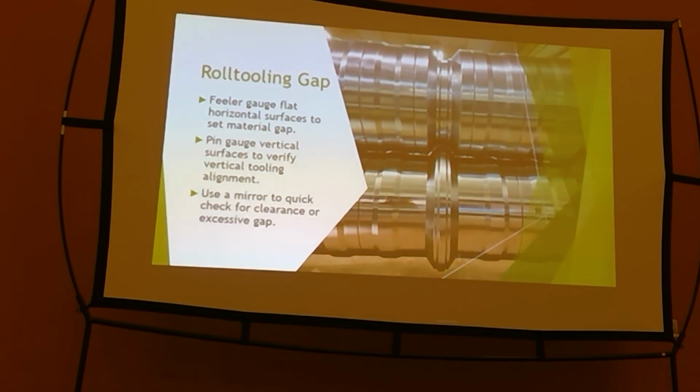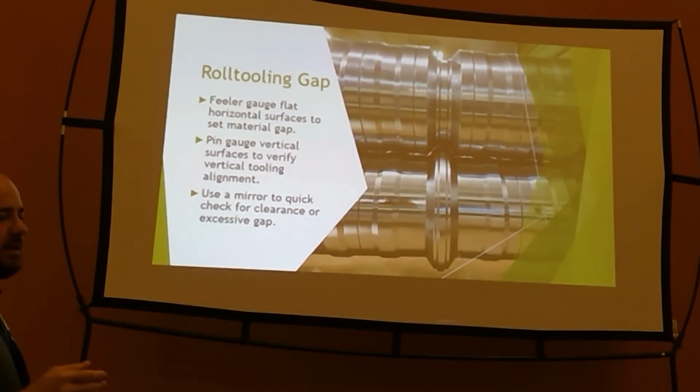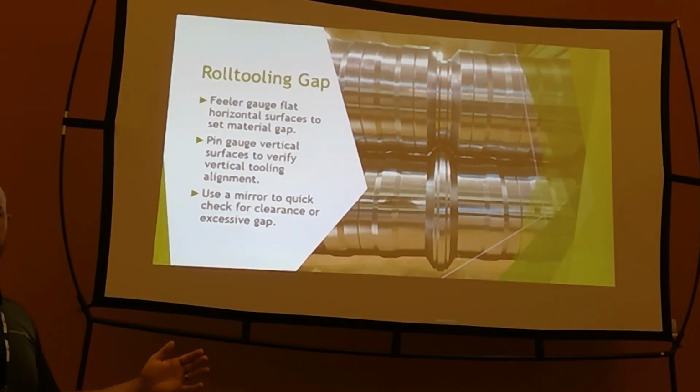It's paramount to get that vertical adjustment correct before you even begin to look at any of your alignment top to bottom arbor, because that angle deflection changes it enough that it won't even line up right. If you change it 60 thousandths from where it's supposed to be, it's leaning, and you're gonna start getting some weird things in your panel. Why don't I lap anymore? Why am I open on this side?